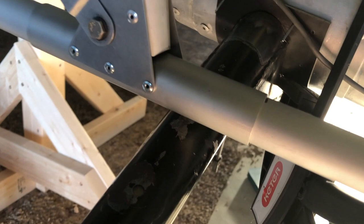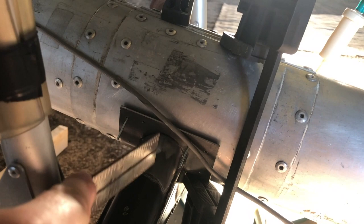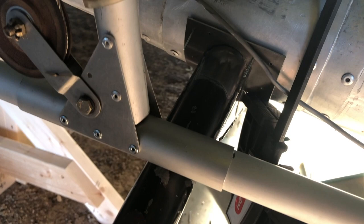I can already see — and it's hard to demonstrate with the harsh sun coming from the other side of the hangar — that I'm closer on this side than on the other. So one thing I'm already going to have to do before final welding is rotate the saddle plate just a couple of degrees on the rest of the welded saddle assembly. We'll take a look at that, but I do have it clamped in place like I said.